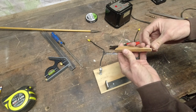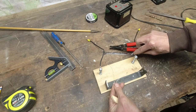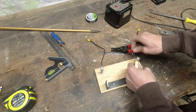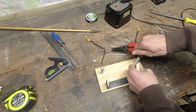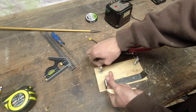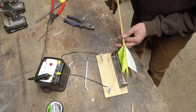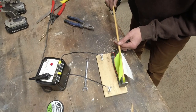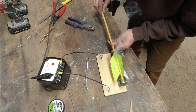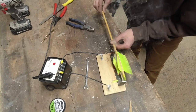The good thing is once you do get it set, as long as you're keeping that same profile you shouldn't have to mess with it too much. Especially after that wire gets hot it kind of keeps its shape. I think it's called nichrome wire — it's just a resistance wire. And here I am just trying it the first time. This is the first cut; I was recording in case something blew up so I would get it on video. It worked pretty good. It stinks pretty bad — if you've ever branded anything it smells exactly like that.